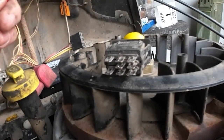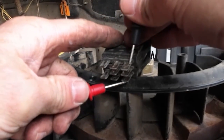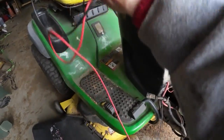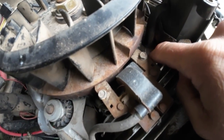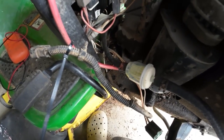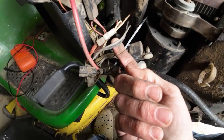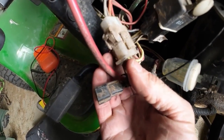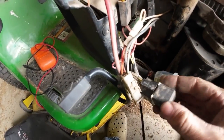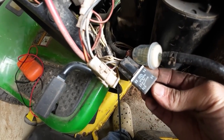If all the switches show continuity, I'm in for a heck of a mystery here. So if all of the safety switches check out okay, that perplexes me. My next thought is this wire we unhooked — maybe wherever it goes, it's just bad somewhere along the way and doing something it's not supposed to. I say let's follow that wire out and see where it goes. These two wires run into the wiring harness, come out the bottom as solid yellow and solid white, and to the best of my tracing abilities, it looks like they loop back into this relay.